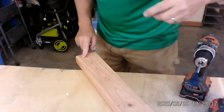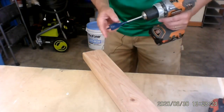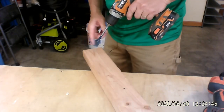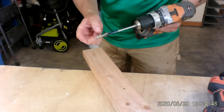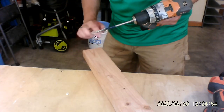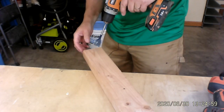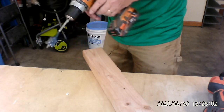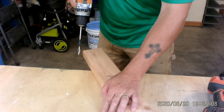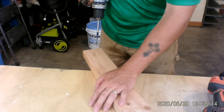Let's go down like this. Our piece that we're going to be working on hangs over the edge of our bench, and I'll tell you why. Because when we're drilling — making a hole with a paddle bit — what you want to do is drill a hole, but you want the spiral or the point to be able to come through just a little. Once it protrudes through, you want to stop. So you're going to be stopping and going to make the perfect hole. I'm going to show you two things: first, what happens when you just punch it through, and then when we stop and go, turn it over, and finish on the other side.